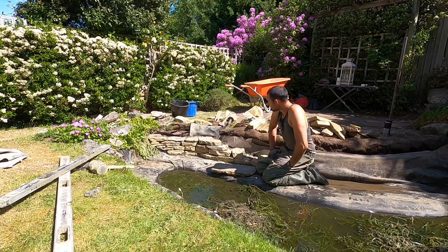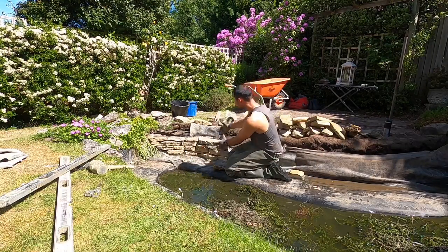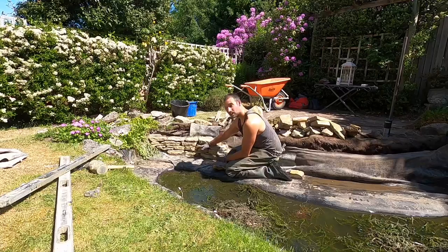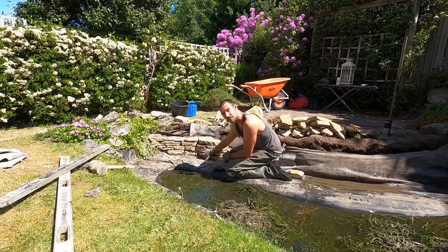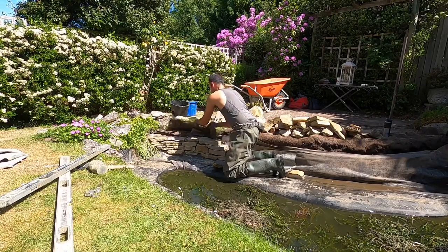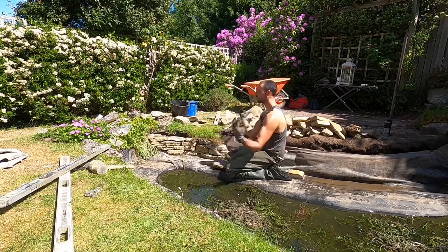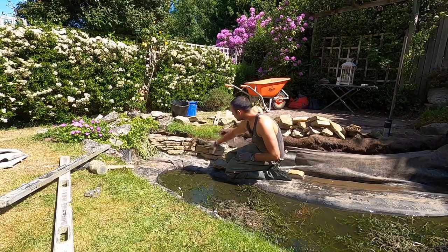Good morning, it's another day and I'm making progress now on the construction side of the job. You can see now what my plan was — having dug out the shelf and created that extra space, I've now started to lay some stone starting on the shelf level, submerged beneath water level. The water line is probably going to be around here so we've got a good six to eight inches of stone underwater and a few inches of stone above the surface of the pond as well, which is nice. Then as I work my way around the pond the turf that was there originally is going to get folded back over, so we've kept the same appearance all around the outside of the pond but instead of seeing that strip of liner — always visible particularly when the pond level drops — we're exposing stonework.